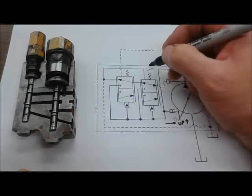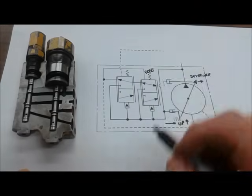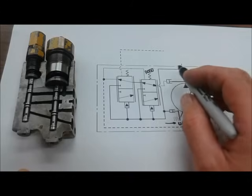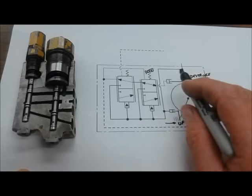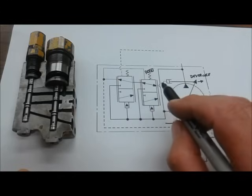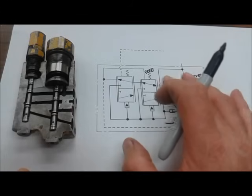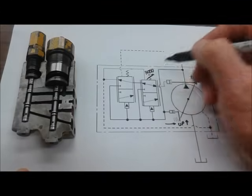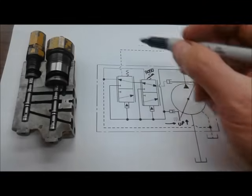So if I was to put a number on that spring, say for explanation purposes 3000 PSI, that would be our maximum system pressure. When pressure here gets to 3000, it would be sent underneath that spool. That spool would lift, connecting that same discharge pressure across the valve, across this arrow, into the destroke piston to destroke it. So the pressure limiting compensator can destroke the pump if necessary when pressure reaches the maximum setting of that spring. And if I were to draw an adjustment arrow through there, that might represent that that setting is adjustable by adjusting that spring on the pump, which this one is.